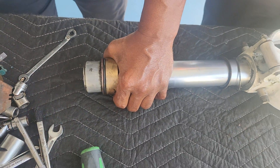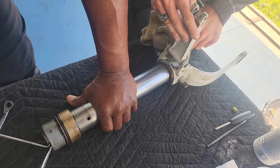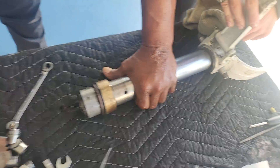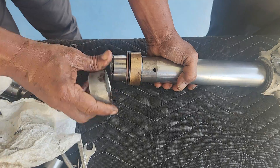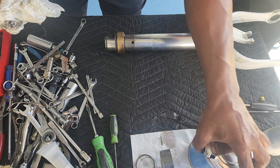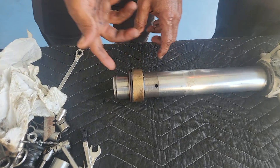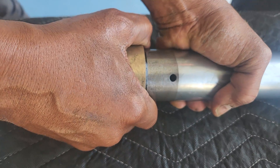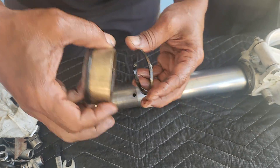So the next step is to take this snap ring here. Just hold that in place. So that snap ring comes off — you put it right there. This comes off like that. Okay, that's your second item. This comes off; the o-ring is to the top. When you put it back on, you can't make the mistake because the scraper is at the bottom. This comes off like that. That's your scraper there.